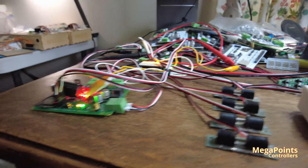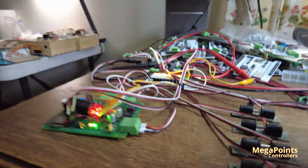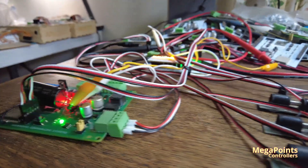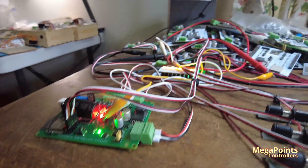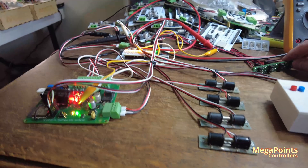The problem with solenoids is you need the capacitor to be charged in order for the solenoid to fire. So if I try and move all four in one go, the first one will fire, but for the rest there's nothing left — the tank will be empty. We've added some smarts here, so watch what happens when I press the button for V-port 1, because they're all now on V-port 1.